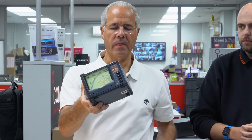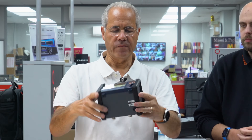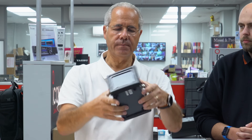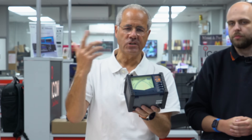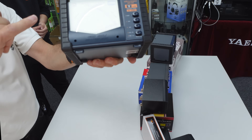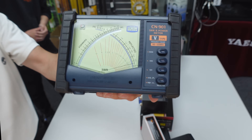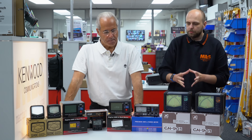The side brackets come off if you don't like them, but they do have rubber feet on the back and plastic on the front — if you've got the bracket on it's not going to slide around. I always keep mine on. The other advantage with the bigger meters is they're backlit, with a socket on the back — so you can wire it up to the low-voltage output of your power supply and it'll turn off when the shack goes off. And there's actually a mirror in the display so you can accurately read the cross needles without parallax error.